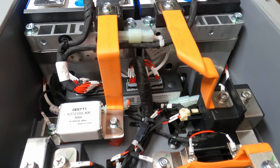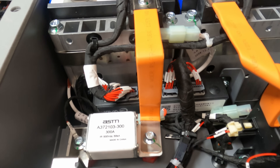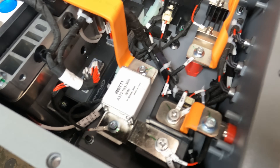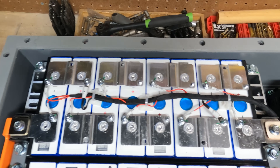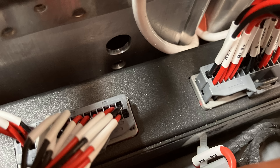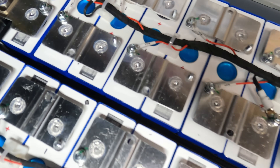Like every other battery, the BMS is the brains of the battery, and a battery is only as good as the BMS. This is not a FET-based BMS — this is a contactor-controlled, EV-grade BMS, and that's why you can get those amazing amperage out of this battery. Just look at these gorgeous cells, the bus bars, the wiring — clean, neat, orderly, and professional. This is a Craftsman battery, put together by somebody who really, really cares. I do so many battery teardowns and this just stands out. It's like art. You get a T-Class fuse, heavy thick bus bars, incredible BMS, and gorgeous EVE cells.